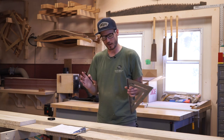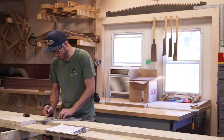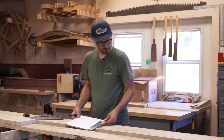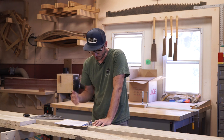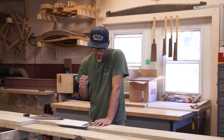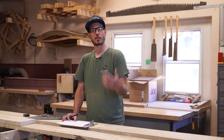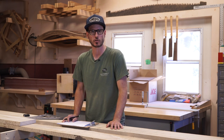It doesn't necessarily have to be perfectly square, but I'm going to go ahead and mark where I'm going to cut it on the saw. I like to mark my part and the saw kerf — it doesn't make that much difference but if there's 30 parts it adds up pretty quick. Once I know I've picked all my parts out, I simply go to my cut list and put a tick next to it. Four uprights gets four ticks, two mid rails get two ticks, and so on. That lets me look at it and know straight away that I have those parts selected — not fully yet, just selected. Once I've roughed them out and know they're going to make it, I cross it out so I know I'm good to continue with the milling.